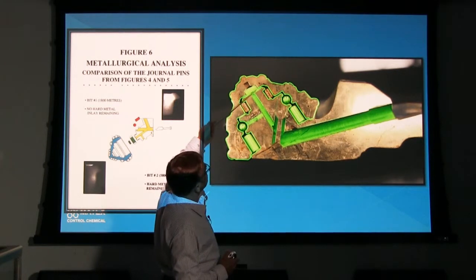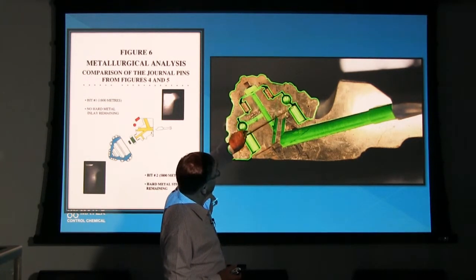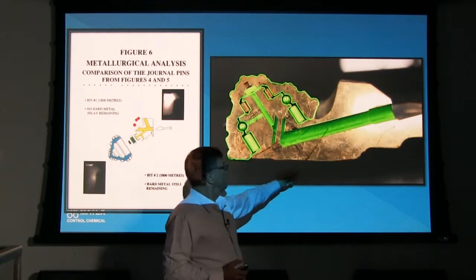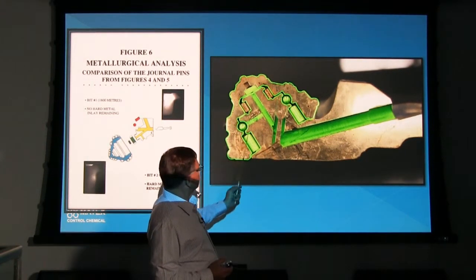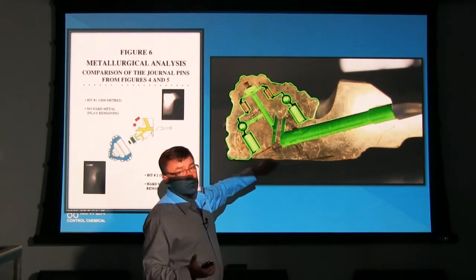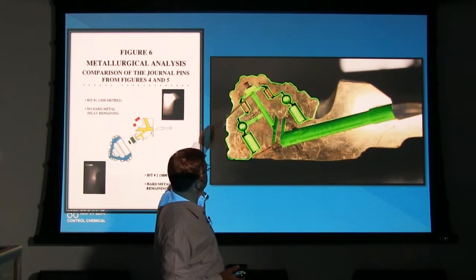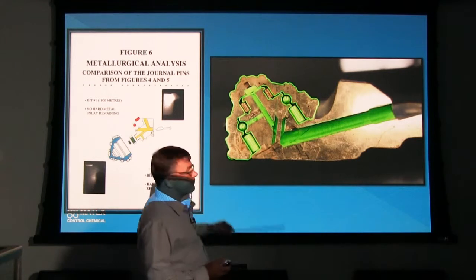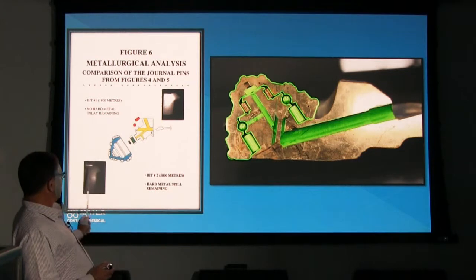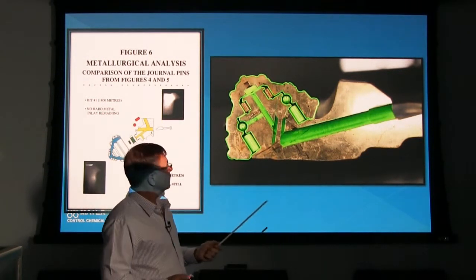However it gets there, its only escape route to get out, as we all know, is over the top of these bearings. And then it's blown out through the back side. So if we're looking at approximately 25% of the air to come down in through here to keep the bearings clean and cool, then why not throw a little lubricant in there, such as TriLube, something that's been manufactured specifically for this application, get it in there and get those bearings coated. This here actually becomes the result of this right here. We've done it numerous times. We've been doing it for quite a few years.